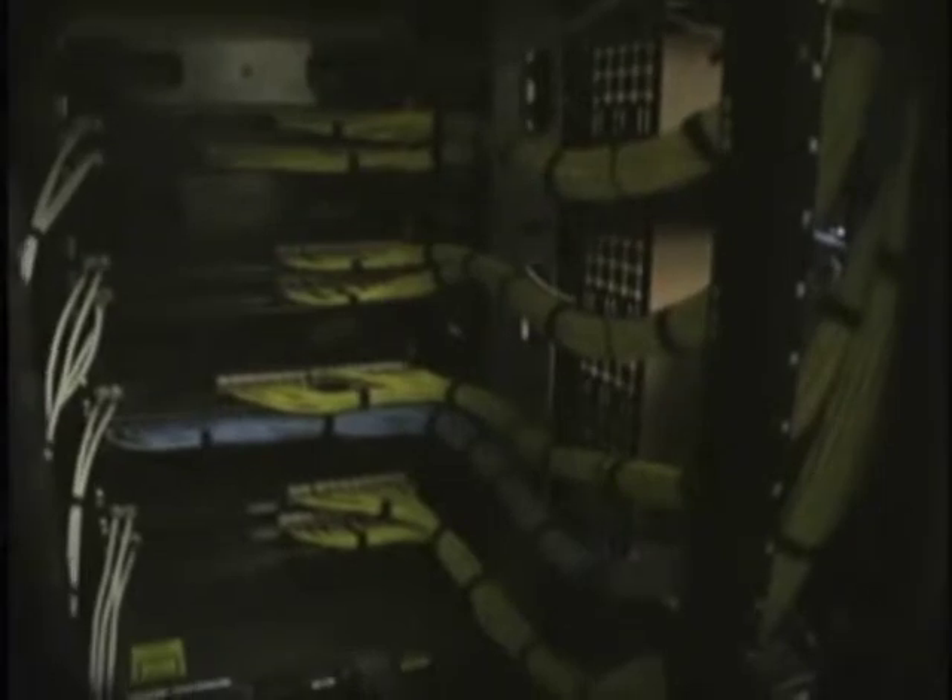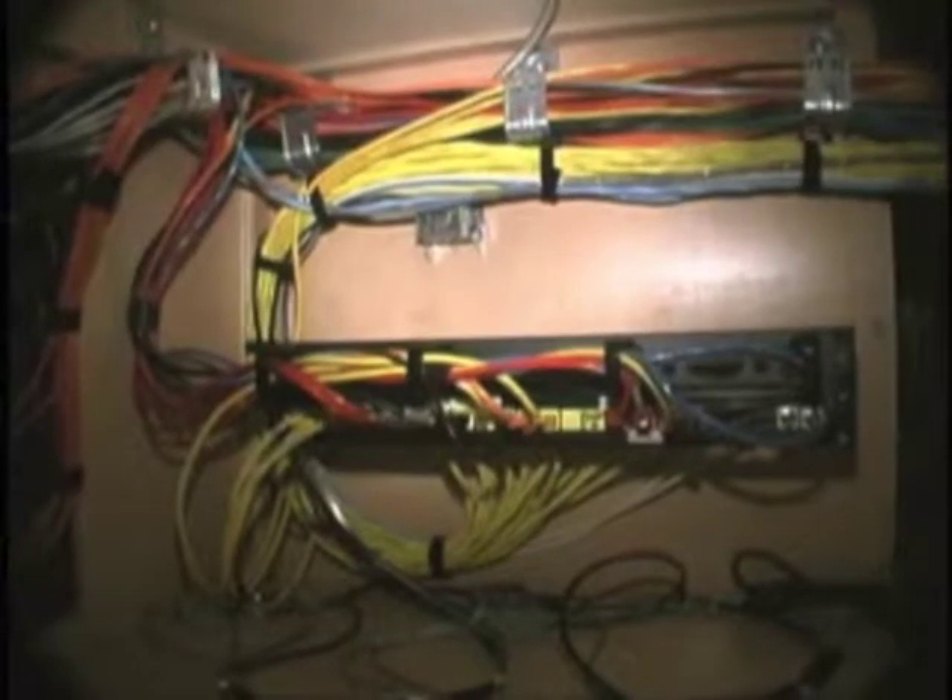We're looking at one of the wiring closets that handles the third floor news studios. We ran CAT6 cable from patch panels just like a regular business LAN, out into each of the studios to connect the Axia nodes into the Cisco switches handling all the audio. Below the Cisco switches you can see the Axia mix engines, all centrally located so all the fans are outside the studios and equipment can be completely quiet. We're running redundant power supplies on the Cisco switches to prevent any failure. We were also able to use vendors that normally do voice and data work for the wiring, which made installation extremely simple.